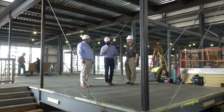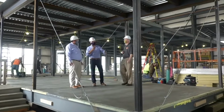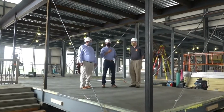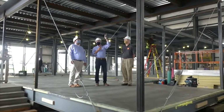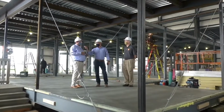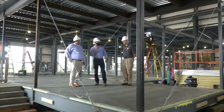Yeah, that's exactly it. And Casey, you can walk us through a little bit of this. So those frames are moved over here with the lift above or with a carrier, set on a foundation, right, a cribbing site foundation with the point loads accurate and where everything needs to go. That's correct. And then what we have is actually the framing here, and then we have the roof system on this one, because this is a one-story piece of this building. Is that accurate? That is correct. Yeah, this is a one-story piece of a building that has a one-story section and a two-story section. And that two-story section we're going to show everybody outside in just a minute.